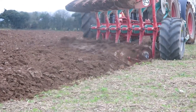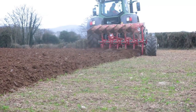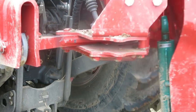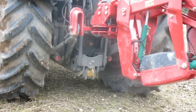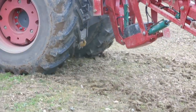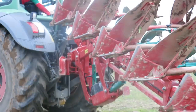And John, what kind of accuracy, what kind of satellite signal would you need to get the best out of this? Well, we can work with EGNOS if we want. A lot of people have the RTK, and that's even better. That's accurate to 1 centimeter. For example, if the plough moves within 3 centimeters offline, then it'll activate and correct that. For the absolute best accuracy, RTK is desirable, but you can work it off the other satellite systems as well.